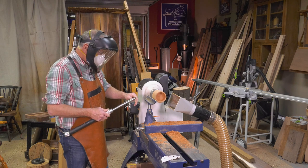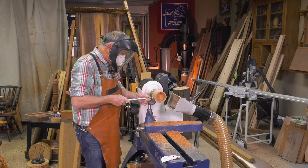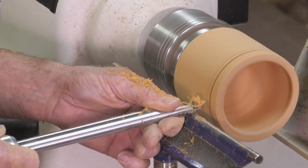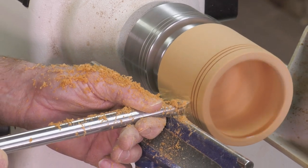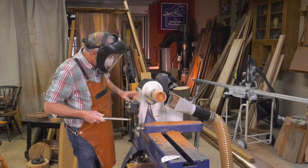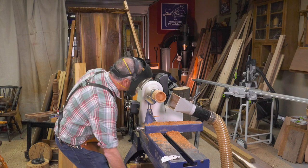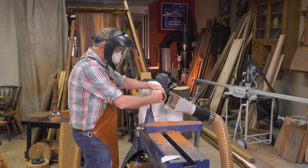From experience, this transitional curve in the bottom — that's the ideal cutter right there. It's sanded and ready to roll. Before I put the finish on, I'm using this negative rake special carbide cutter, diamond point. I want to be careful with this — gentle. One goes straight in. The walls are deep enough, right at half an inch, so I can go in about three-sixteenths. There is, in the universe, a very special number: number three. I often put those three rings on — it adds a bit of mystery to it. That looks really good. I'll do just a spot more sanding, then friction on some high performance water-based finish, and we'll take a look at how all this comes together.